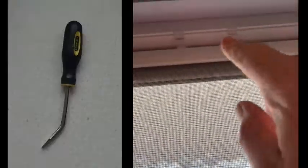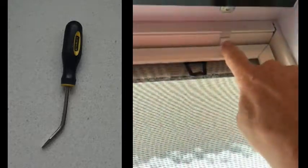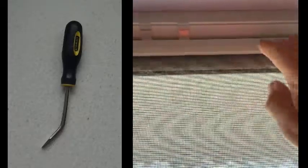The screen I'm going to talk about is an internal fly screen. If you'll notice on here, it has these little plastic clips. Now you can push these, however they get brittle and stiff — the minute you push that, it breaks. Once they've broken, the screen is useless — it just falls out and flops about. You need to get the top out first because you need to lift the screen over this lump here. Another poor design — these are a terrible window design clip. Now they normally sit out on the edges, so the best thing to do is to nudge them over to the middle. Because what we need to do here is rather than push that plastic in, we're going to bend or bow this fly screen section there. The best way to do that is to use a screwdriver. Now if you're going to use a straight screwdriver, the problem you're going to have is to get it in and be able to lever this down — it's just not going to work. A straight screwdriver is absolutely useless.